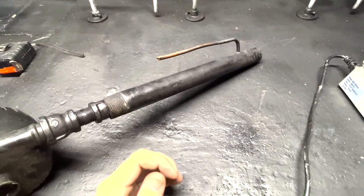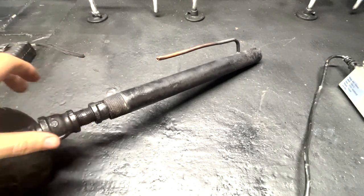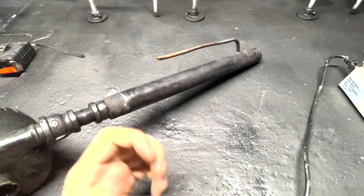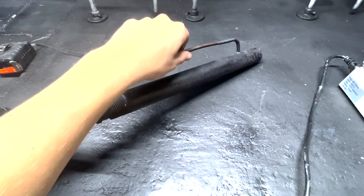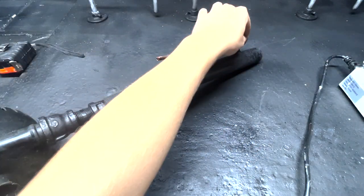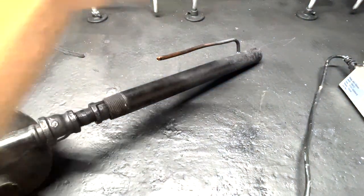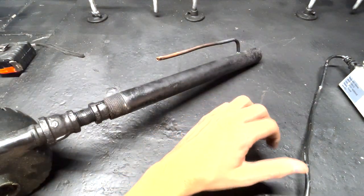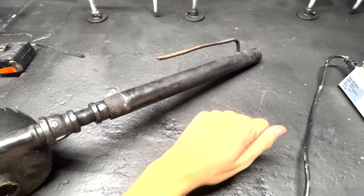So the basic idea of how this works is first our air enters through this port right here. And since it constricts, it makes the airflow much higher velocity. And then up here is our oil drip tube. So this is where our oil will be flowing into our burner. Now, the way I have this positioned is this oil drip is right in front of the output of our high velocity airflow. So when the oil falls in front of that, it atomizes it using the first principle that I talked about. So that'll make it much more flammable, which then can enter our combustion chamber and burn.